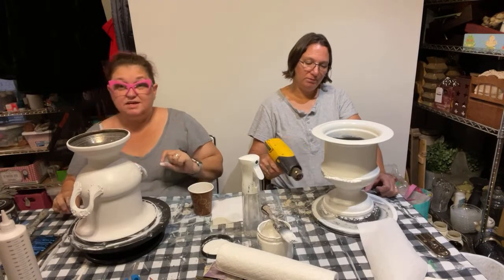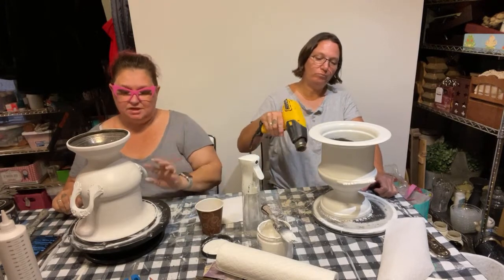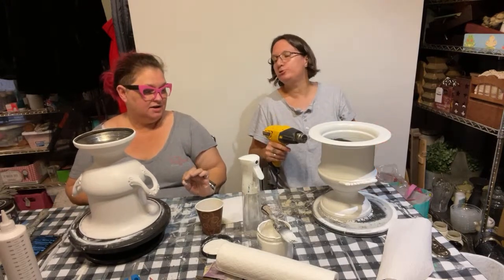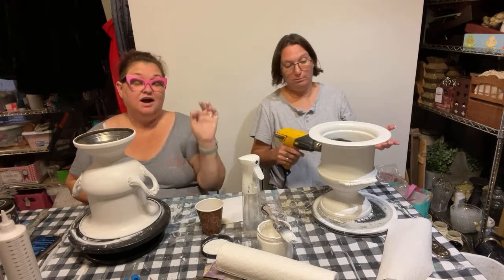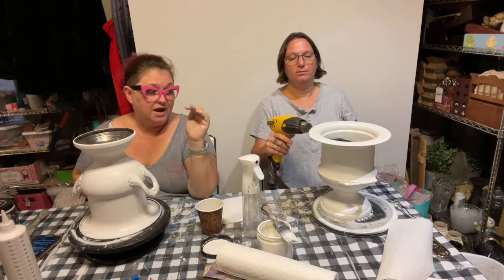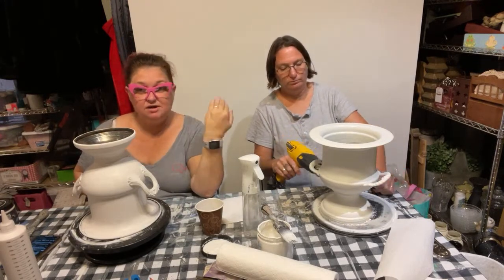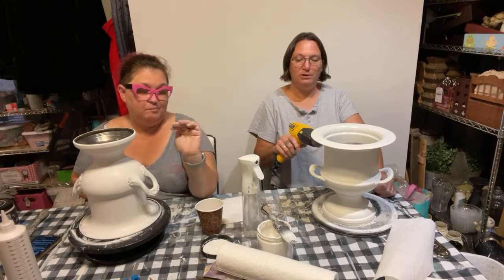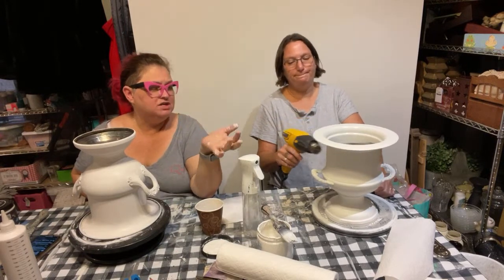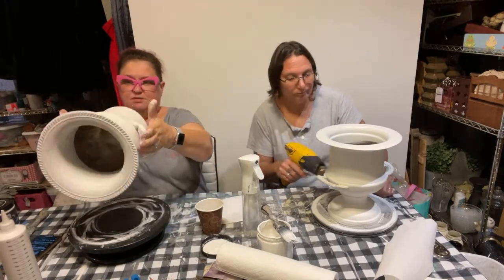Jessica, I haven't heard that you can add up to 10% water. I have heard everything the opposite. You really need to reiterate what it is she's talking about. Sorry. On the silk mineral paint, you are not supposed to add water. I know that you can mix other things in up to 10%, like a Floetrol or something, like if you were spraying. Silk is thin enough, you shouldn't need to dilute to spray it. It's a nice thin paint.